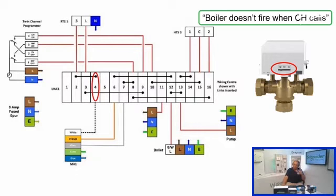But obviously you could do this the other way around, where the first thing is if you clock that the valve is in the heating position, just pop it off. But I have seen it a lot of times where you can't actually see the indicator on the valve actuator, because it's facing a wall, and you can't really see it unless you've got a mirror. So electrical checks prove it exactly, but it's certainly a good indicator to look at on the side.